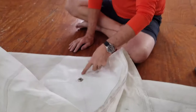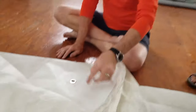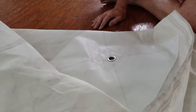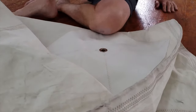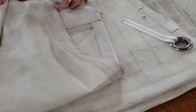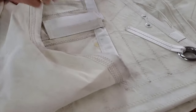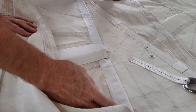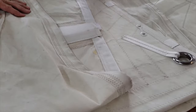This one was beaten up really badly. I've taken that apart and dealt with it the same way we did at the top. I put a new piece of folded three-inch here because this was a little chewed up. So when the batten pocket was off, I put a new piece in there. This one didn't have any issue because it really didn't have the monofilament cord coming out across the leech.